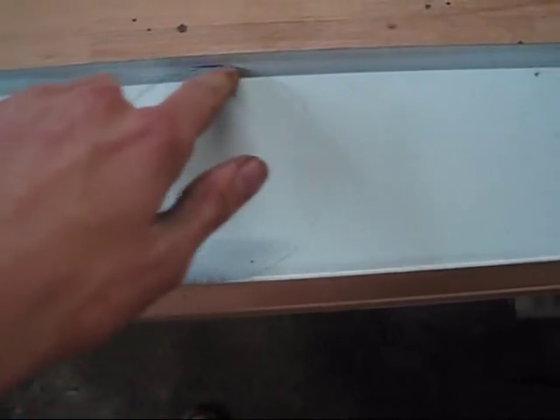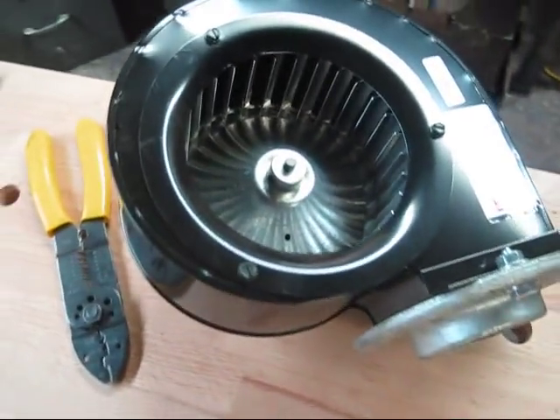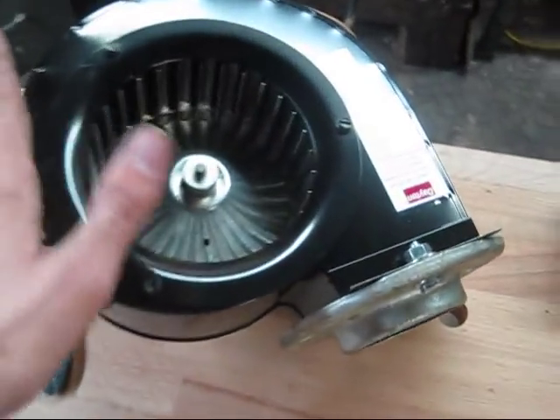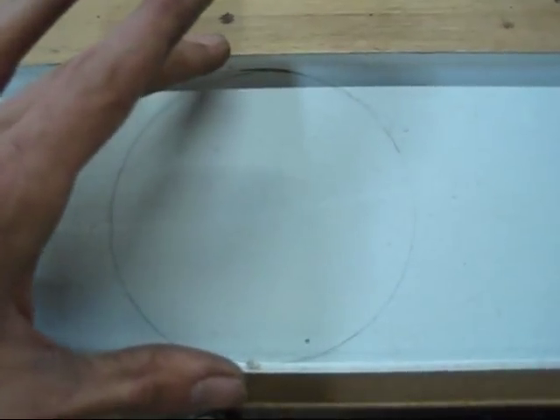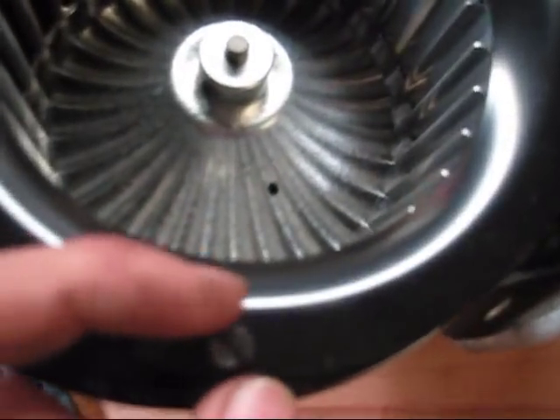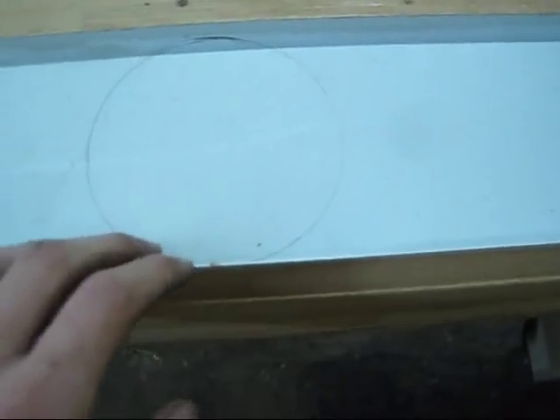What I've done here is I've drawn a circle on a piece of steel that I'm going to use for the intake. The intake right here is four and a quarter inches — if you measure from this point to right here, it's four inches and one-quarter-inch. The flap does not have to completely cut off the air, because you're never going to want to do that anyway, so if there's a little bit of a gap, that's fine. It's exactly four and a quarter inches wide. I'm going to bend it over and drill a hole through there for this screw. I'm going to leave this flap on as kind of a handle so I can swivel it back and forth to judge my intake. The steel is maybe 16 gauge — it's actually a cover off of a fluorescent light fixture. I'll go ahead and cut that now.